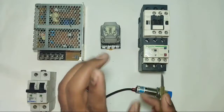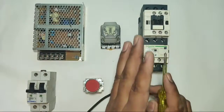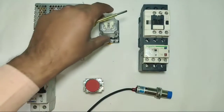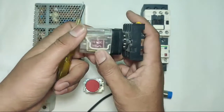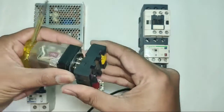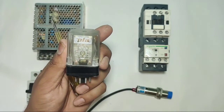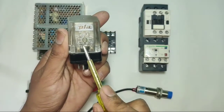When the sensor operates, first the glass relay operates, then our motor starter will operate. This glass relay operating voltage is 24 volt DC. We can see the glass relay operating voltage is 24 volt DC, and this glass relay is an 8-pin glass relay.